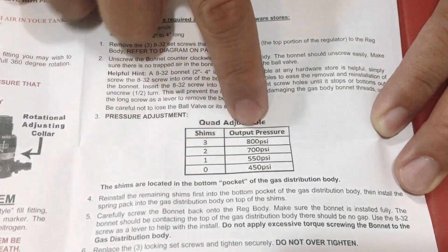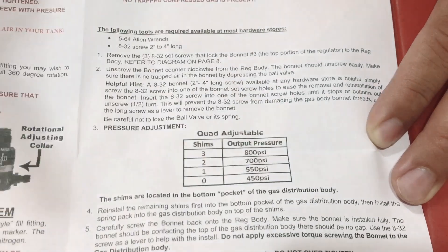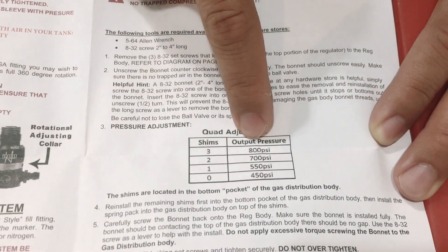So, if you are shooting a high-output pressure gun — in this case most normal guns, for example you're shooting the Dye or the LV1 — you need a high-output pressure regulator. If you are shooting guns like the CS2 or a MacDev gun, then you need a low-output pressure.